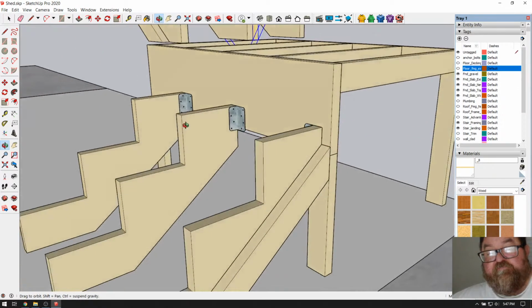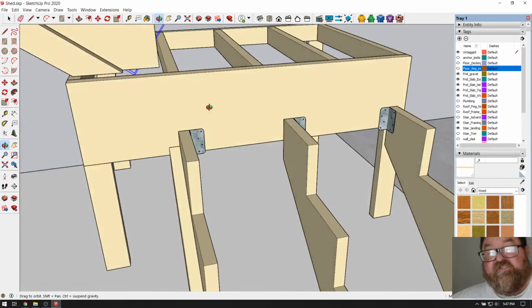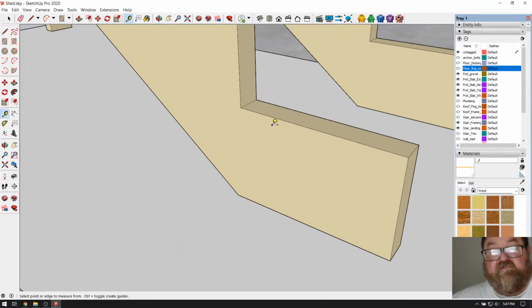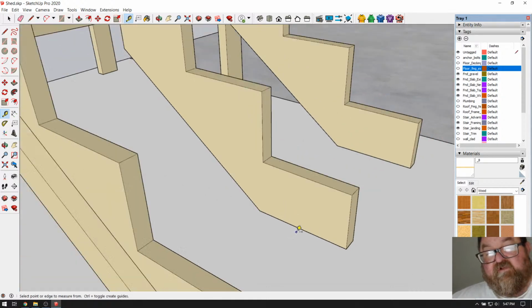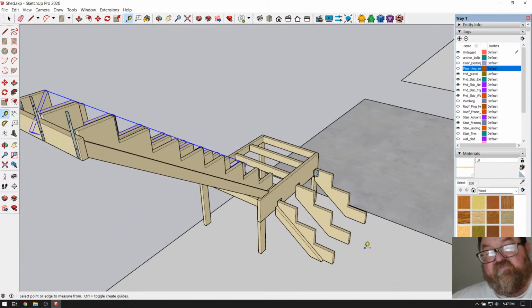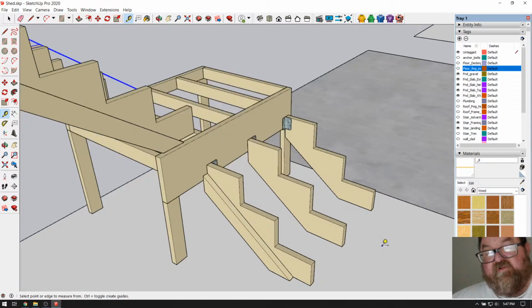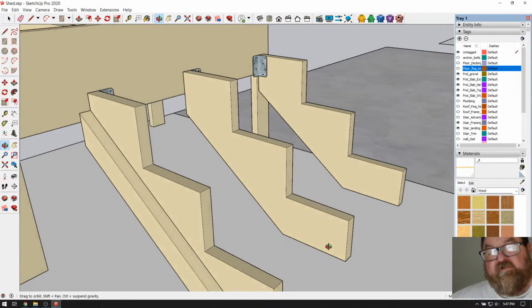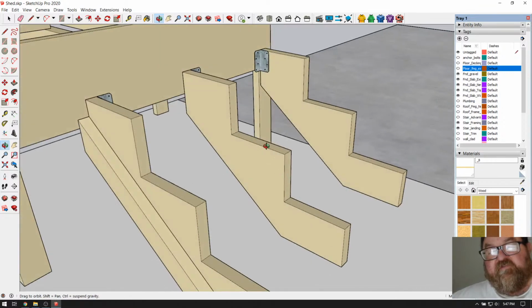Now, you'll do these smaller stringers exactly the same way, okay? Let's see what they're cut. 6 3/16. Coincidence or not? No, because we're using the same thickness on the floor, on the concrete as the finished floor. We're using an engineered or a laminate flooring that's 12 millimeters, basically a half inch. So this bottom stringer's cut exactly the same. There's just not as many risers.